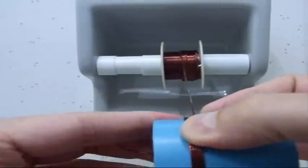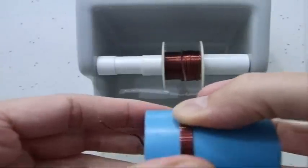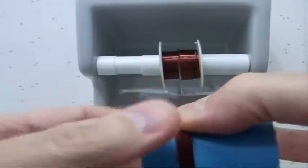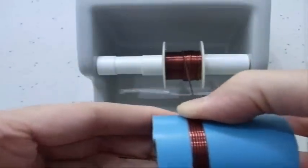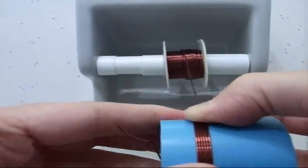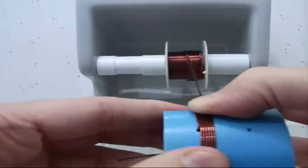You may ask: would this coil work for radio? The answer is yes, it would, but it would not pick up very much — it would have a very limited range of frequencies. The longer the coil, the greater the range of frequencies, but it also becomes harder to tune because your tuner rod has to get longer and longer to sweep across it.